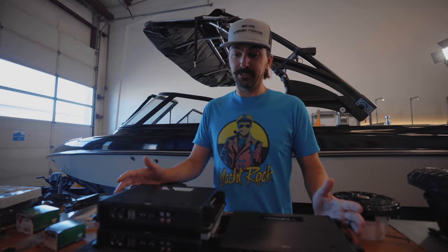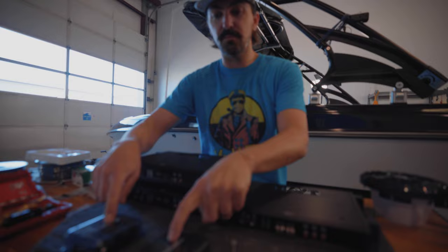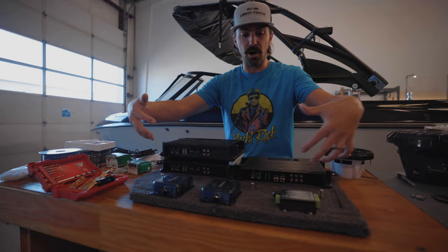Back in 1999 we didn't have quite the advanced sophisticated stereo going on in there, so we had to retrofit a little panel to be able to mount our amps to, along with our distribution blocks and our RGB sensor. We're going to be able to get this mounted into our observer's compartment. Because of those walls on either side, we don't want anything poking through making more work than we already have to. We'll put it on this panel so we can get it mounted nice and flush and route wires to the bottom to keep moisture away and get it sounding good on the water.